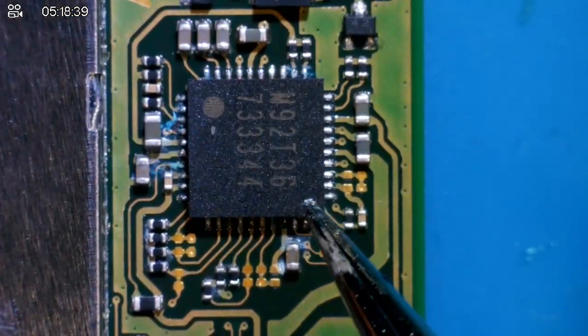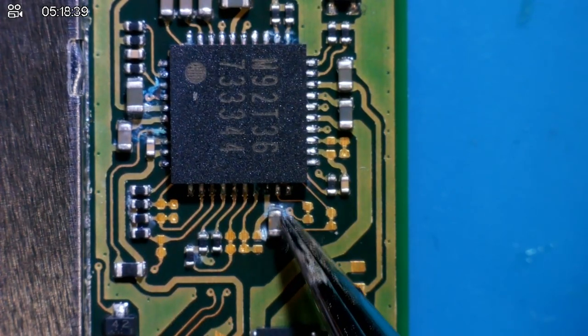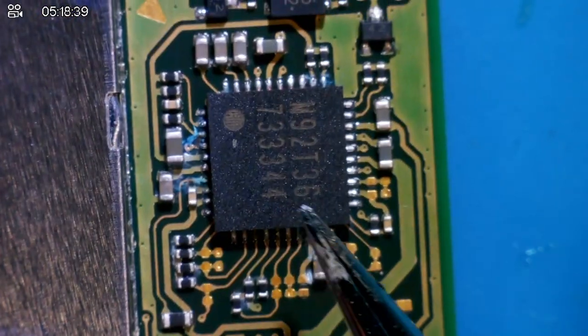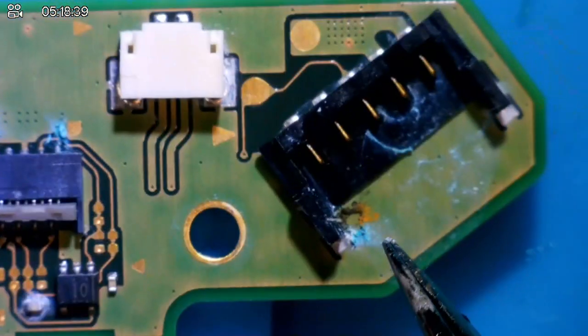Holy, okay. I didn't see this on the face of it. M92 has quite a lot of bad water damage, especially around, this is the CPU capacitor. I'm praying that this isn't short to ground. So you can see we're going to need to do a big clean around here and double check and see what's working around M92. If we come down to BQ, which is where I saw the initial damage with my bare eyes, we'll start with this connector.